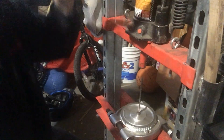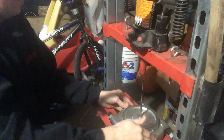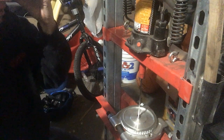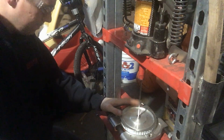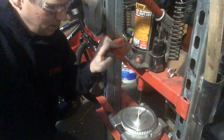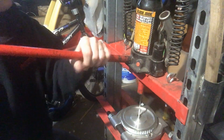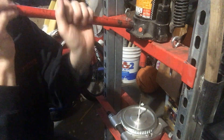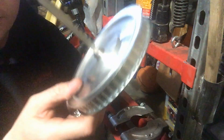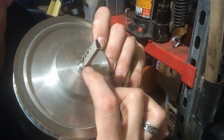Safety glasses are important. You just start going down - it should cut really easy. If it binds up or doesn't feel right, if it's too hard, you need to stop. It looks like we actually bottomed out the press - we'll take it back up. This is halfway through the process - you can see we're cutting the key. The important thing on the back side is to make sure it's sitting flush within your other tool. This one's working good.